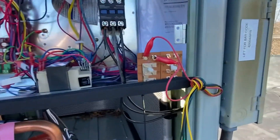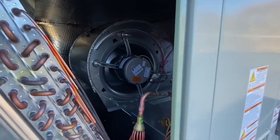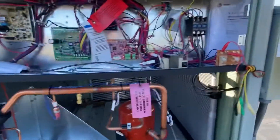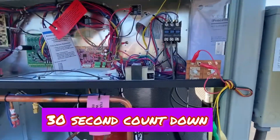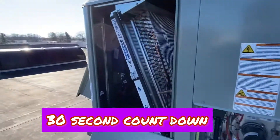So now you leave it connected. Our first step was the blower came on. It's going to go through a countdown and then go on to the next function. The next function should be the economizer, so let's see if that starts closing.